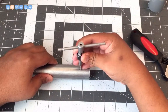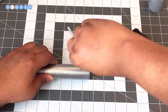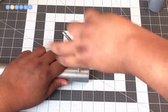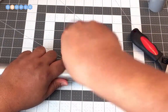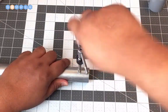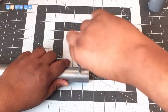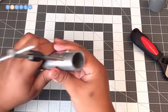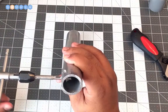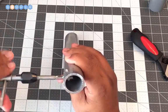What you do is take your tap, insert it into the hole, and it'll stop on its own. Then all you do is apply some downward pressure, turn it, and it'll start to cut out the grooves for your quarter-twenty set screw. As you go in deeper you'll start to see some of the material coming out of the hole. You don't have to go all the way in — about halfway — just to make sure you've got the entire wall thickness. Then just back out.